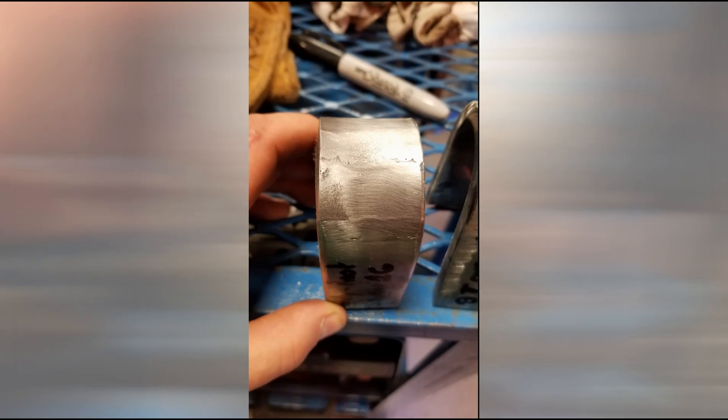The next example done by Andrew is generally clean. There's a little bit of marking on the surface, and that is basically from the prep. Had the plate been ground a little bit cleaner, that would not have been visible, and the root pass we're looking at is acceptable.